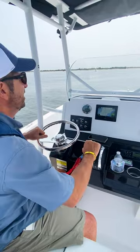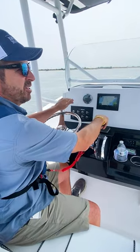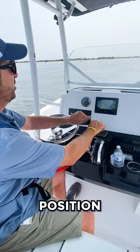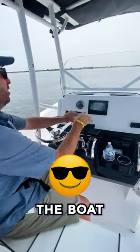What you want to avoid is: folks will go to gear and the boat doesn't move, so all of a sudden they apply a lot of throttle — and that's too much. It's a matter of getting comfortable with that throttle position where you're just laying in a little bit of throttle, not a lot, so that you can properly maneuver the boat.